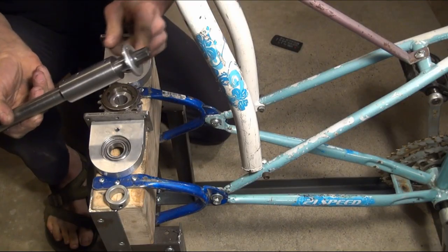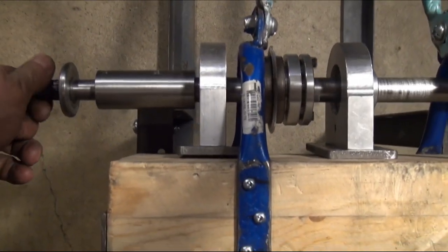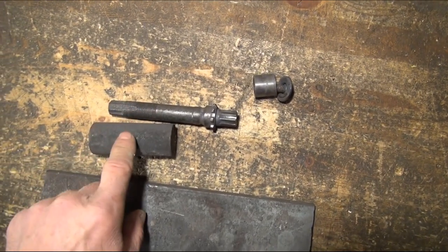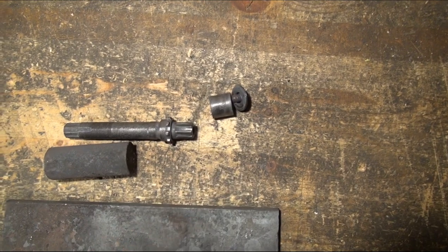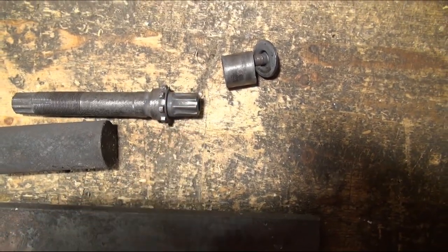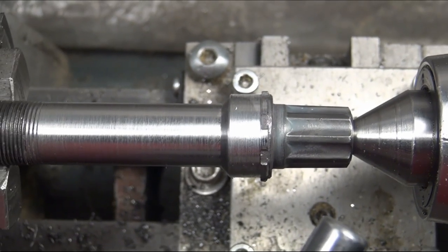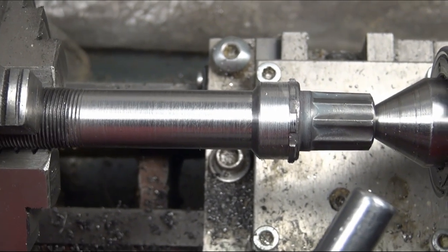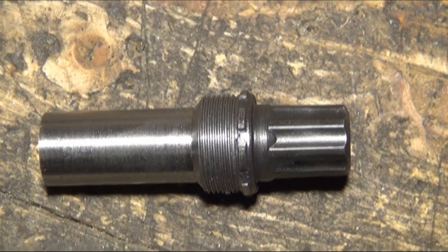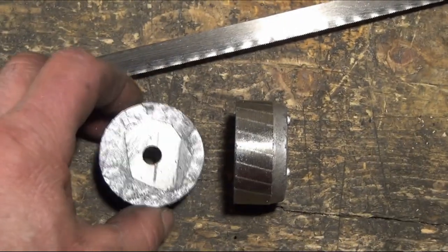Here are the parts for the pedal drive shaft. On the far left, the male coupling is made from a piece of steel bar and a crank spindle that were annealed, with a short piece of tube protecting the splines from direct flames. The spindle was turned and threaded, and an old motor rotor became a handle for the spindle.